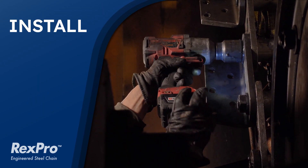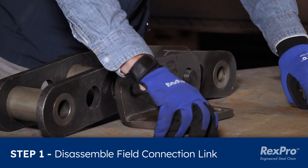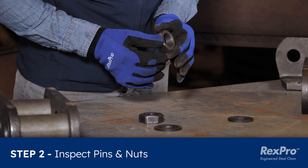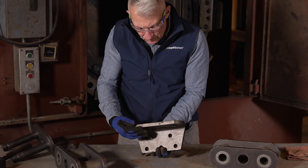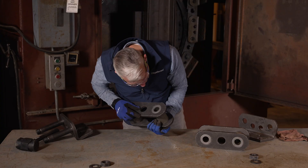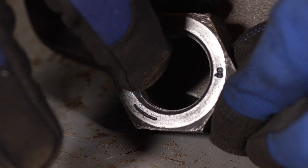On to the installation. The first step is to disassemble the field connection link. Loosen the nuts and remove them from the pins. Remove the washers and cotter side sidebar — which is stamped with a C in front of the date code — from the pins. Inspect the pins and nuts; these parts should be free of nicks, burrs, and damage to the threads. A nick or burr on the pin can damage the cotter side pinhole, which could affect chain life. Damage to the pin threads or the nut can result in stripping the threads, which will prevent a proper fit in the sidebar. If the pin threads are damaged, this can be addressed by chasing the threads with the appropriate thread die set. If the nut is damaged, replace the nut.